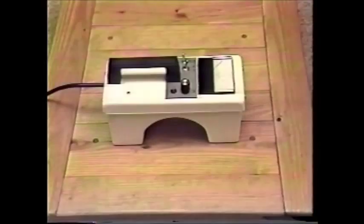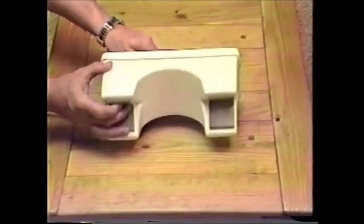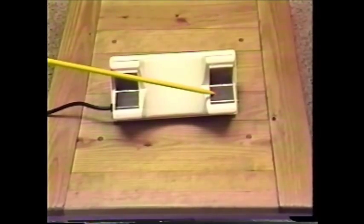The 6799 uses both a reduced voltage and length. The length between the electrodes is 6 inches and will detect a smaller defect than the 12-inch spacing. The applied voltage is 2500 volts. The scaling factors for the tester are as follows.